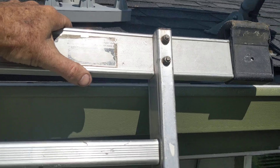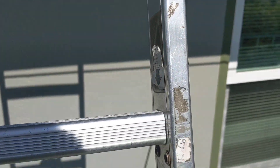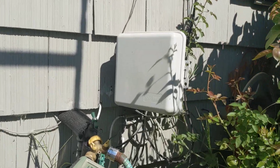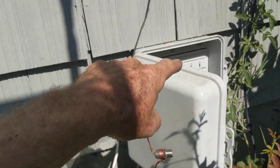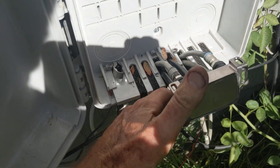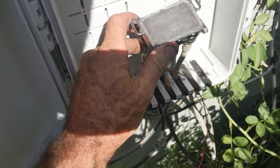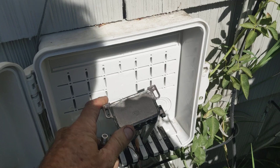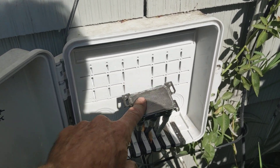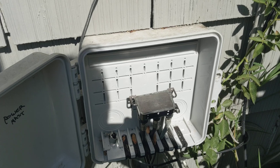Now, if you're converting one of these antennas or using the existing wire, one thing you want to keep in mind is that a lot of times there's going to be a little device in between that looks like a splitter — it's called a diplexer. This is just a splitter here so we don't have to worry about it. But I've seen this on two or three occasions now where you wonder why no TV signal is able to pass through the coax, and it's got a diplexer in between that's designed to block the TV signals.